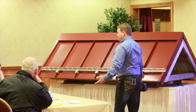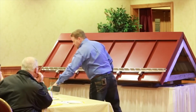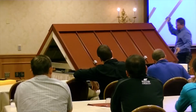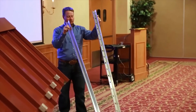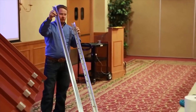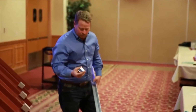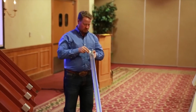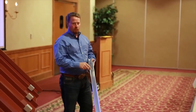So I've now installed 5 clamps fairly quickly. At this point, it's time to install the cross member. There are 2 options: punched ColorGard, which is punched on 4-inch centers, and unpunched ColorGard. The unpunched utilizes a VersaClip. The VersaClip slides into the notch and gives you a hole wherever you need it. This is handy for more things than one.